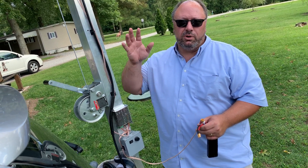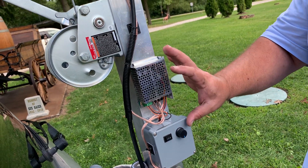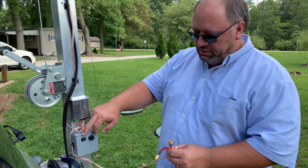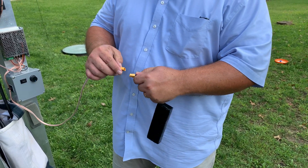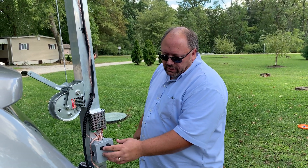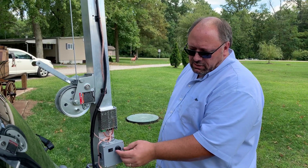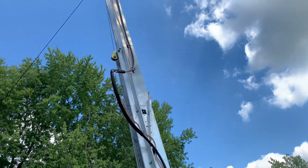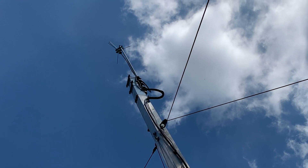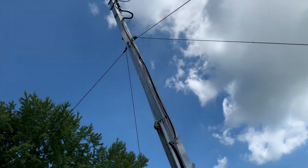As I was talking about before, this does have the ability to rotate an antenna. So these are the controls — this is just a 12-volt controller right here, and it's mounted in a box. This whole thing needs to be mounted in a waterproof box — I just haven't found the right box yet. All that's in here is just these two wires. You can use any 12-volt power source — in this case I'm just using my drone batteries — 12-volt from a go-box or any 12-volt battery. This is directional, and it even has a built-in brake, so if you set it to a direction, you're set. This controls direction, and this is the speed it turns. So if that was a directional antenna, we can set it either way and change the speed at which we change direction. If you're trying to get that far contact, throwing a Yagi up there would be amazing to get the signal in the right direction.